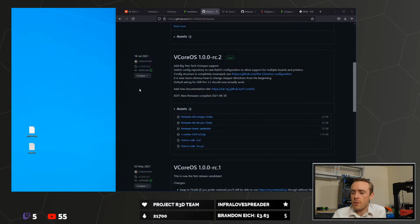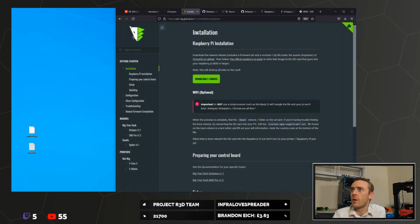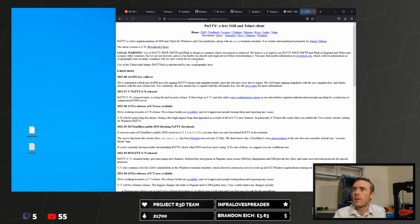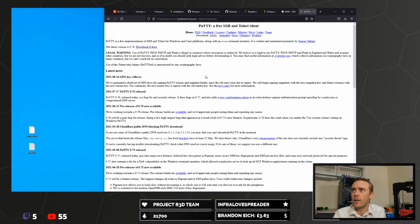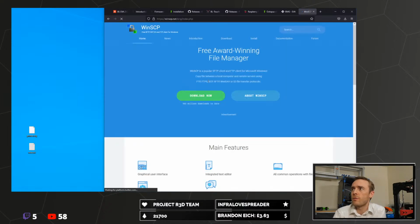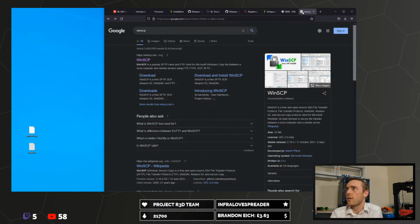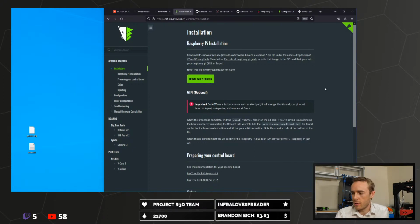So once we've got those downloaded, then you probably need, so I've not run through all these instructions before, I'm new to these instructions, but previously I've also used PuTTY and WinSCP. So this is PuTTY, an SSH and Telnet client, for connecting to the Raspberry Pi directly, if you want to run commands directly on the Pi. And WinSCP is a really good utility for transferring files, so if you need to transfer a bin file or a firmware file over to the Raspberry Pi, this is a really good way to do it. Those links are in the description if you need them.